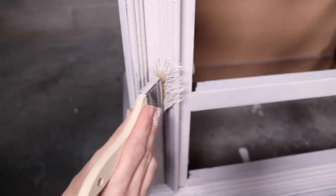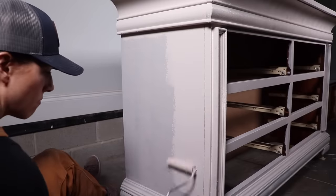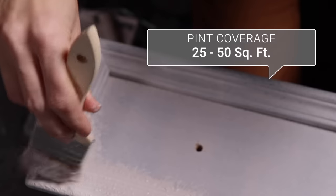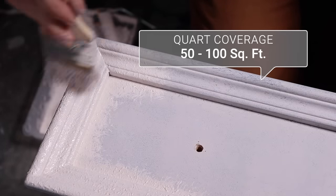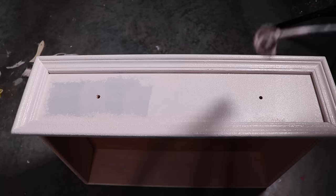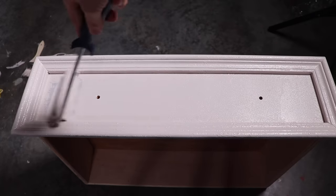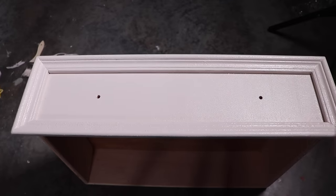This piece is really dark and I'm going to a light color, so you're probably going to need three coats — and in this case I did need three coats. The last time I did a project going from dark over a lighter finish I only needed two coats, so keep that in mind when ordering your paint. I was able to get three coats out of my pint. For most dressers you're going to refinish, a pint will do just great.